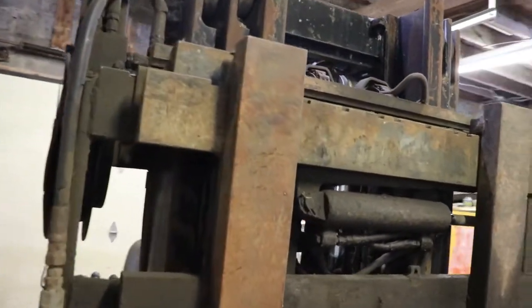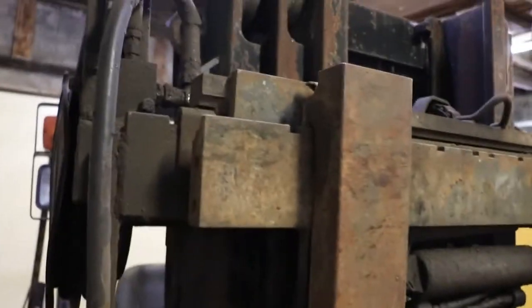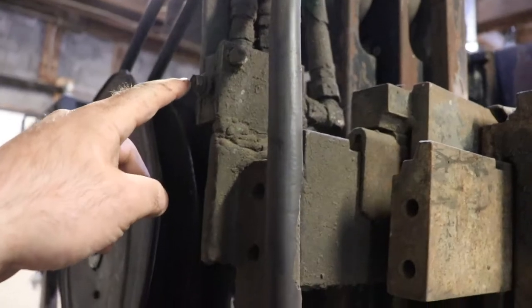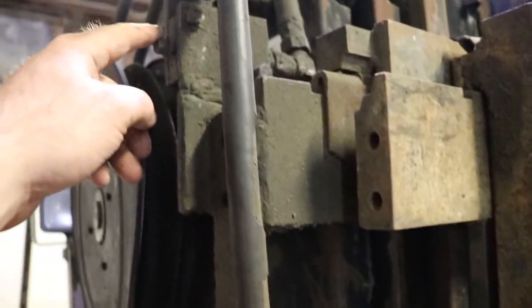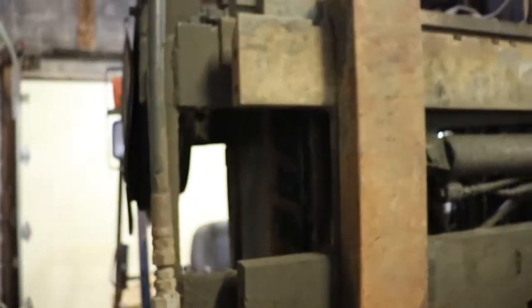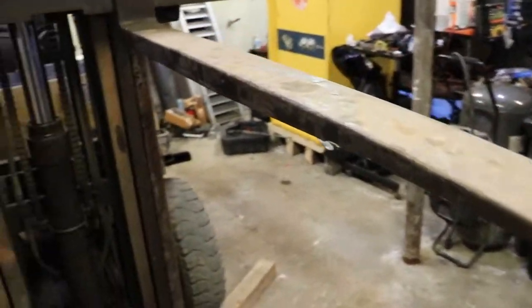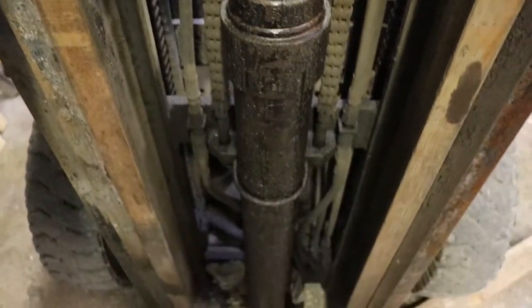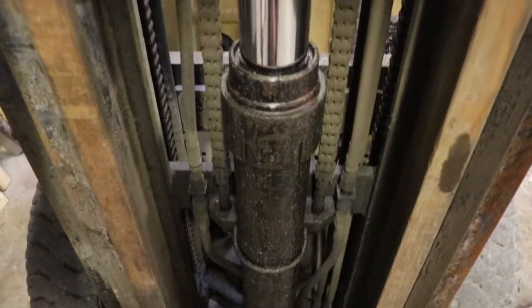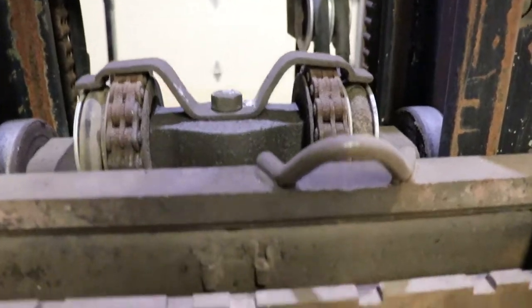It must have broken a hose and just chucked it out - there's just a quick connect on one side of the block and a bolt on the other side. I assume they broke the hose and threw it out, kind of in a vulnerable location where it's sticking out. There are a lot of rollers on this mast that I have to go through and figure out how they're doing. The seal that's supposed to be in here travels up and down the mast, and you can see it's been leaking - they put a diaper down at the bottom.